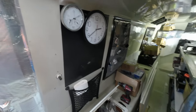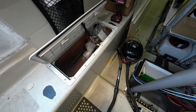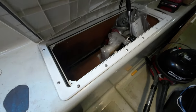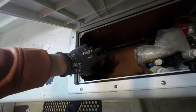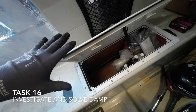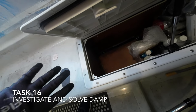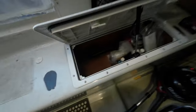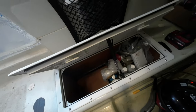I don't find many problems on this boat, but something down here in one of these storage zones — this used to be in foam insulation — there was a bit of damp in the corner and even a little bit of mould going on. So I've emptied it out, dried it up by keeping it open, put some anti-mould spray in, and let the whole thing recover. I'll find out what the source of that leak was — I'm a bit confused about it. Then the whole thing will be reprimed and painted and hopefully that'll be okay.